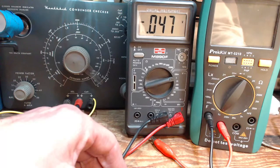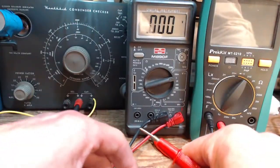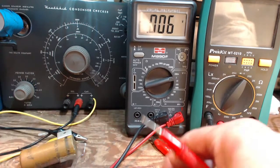That's really, see, there's a voltage on this one too. Now you might want to argue with me that it's just dielectric voltage reappearing, even though the capacitors have been sitting here. I did put them on testers, I did put voltage on them, and maybe this is just the remnants of it. You'd have to imagine how low is that going to go, because I'm not going to wait long enough to find out. As I said before, I really don't think these capacitors are that bad in this respect, but I thought it was worth going through them all. Okay.